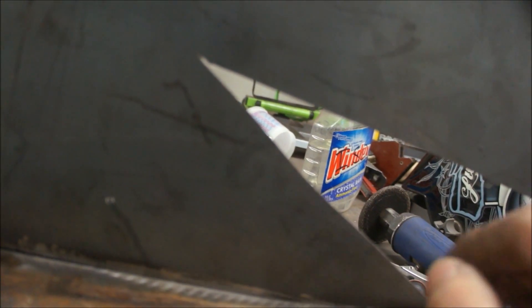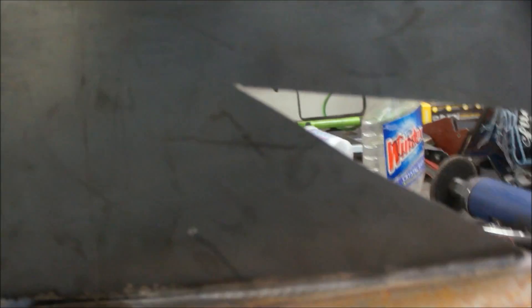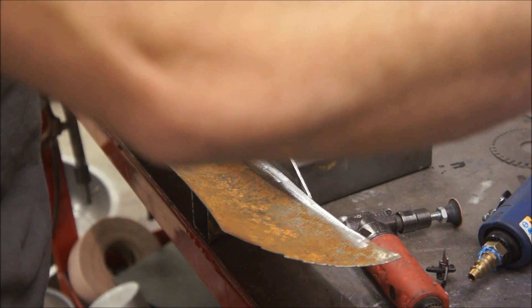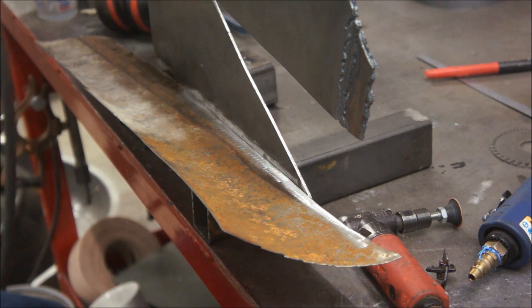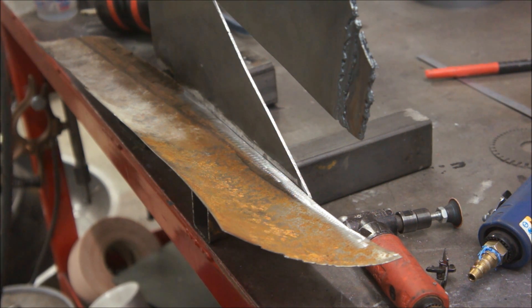My understanding is you're going to spend more time up on the thick steel, then just drop down briefly to the thin, then spend more time up top — so you're hesitating just a little bit at the top and then dropping. I'm going to go ahead and try this and see what we come up with. I'll set you up on the camera tripod. Alright, here we go. Let's see what happens. I've seen this technique on TV once, so let's see how this works out. I'm going to start off with a little series of tacks just to get this thing to hold itself.